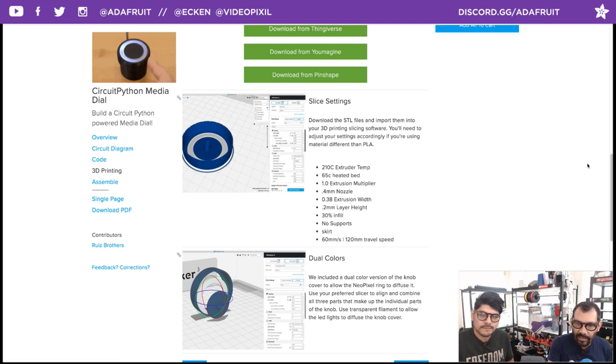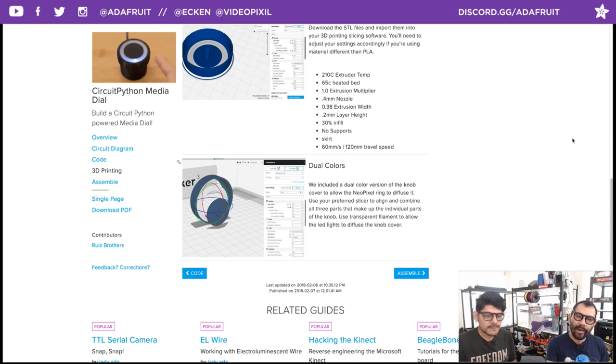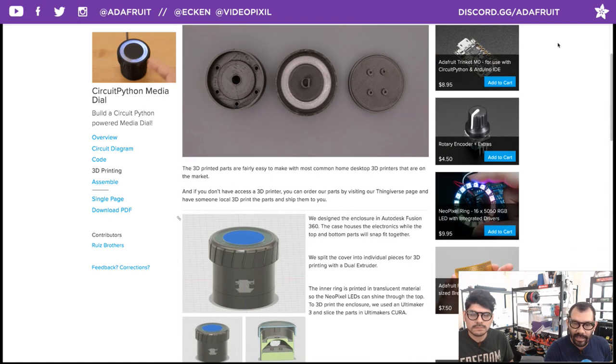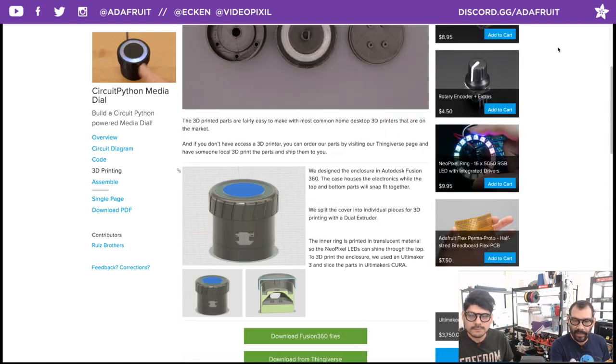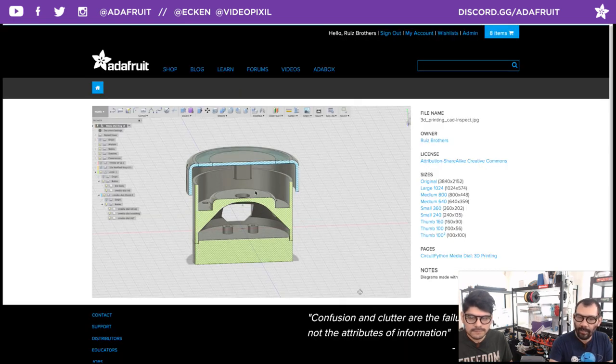And if you scroll down, what else do I have on there? No support material required for any of the parts, right? Yeah, okay. Even the middle part, if you scroll back up and take a look at the cross section, you can see that it has this ginormous fillet on the top there, so you're not going to need to add any support materials for that. The overhangs for the USB port opening should print fairly well with just your standard active cooling fan.